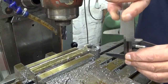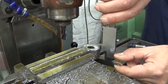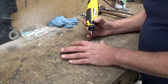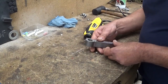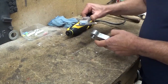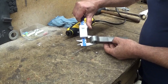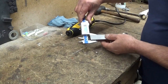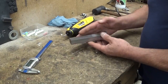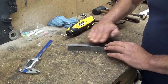Right, this should be more or less 23 millimeters. And it is. That's good. It's obvious I need a lot more practice with this thing here. Now, just simple curiosity, is it parallel 23, 1/10 of a millimeter? That's a lot. But of course, for this tool holder, it's not important. It's just good to know that sometimes I have to pay a bit more attention for parallelism.